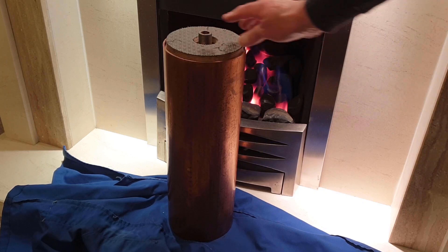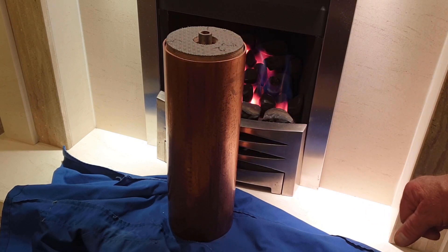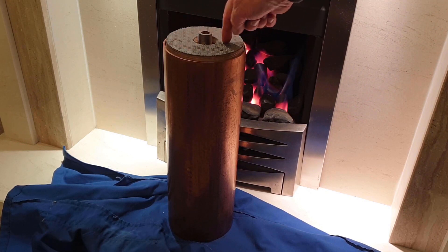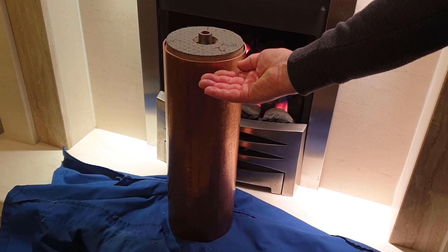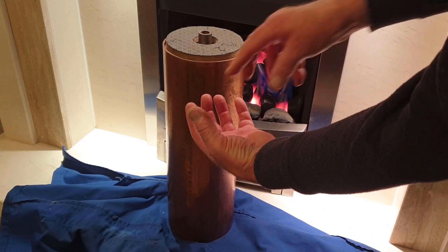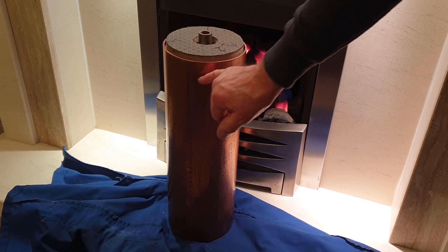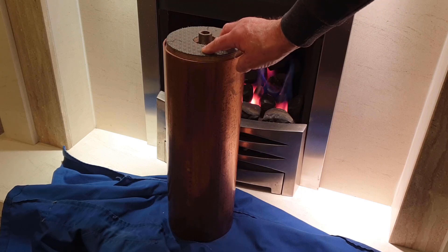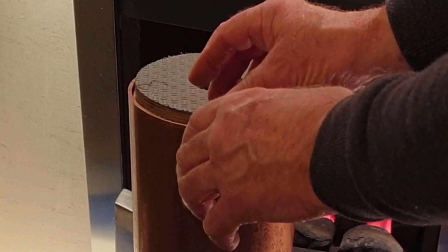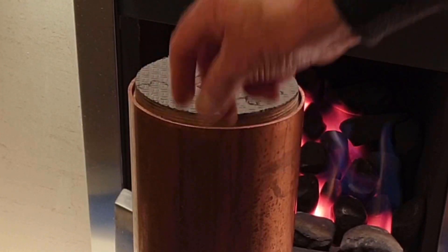So what's going on here? I've had a bit of a setback with the boiler building in that I've left this set up by the garage door and it's been quite damp of late. What we've got is a wooden former with a steel disc on the underside, all sat inside the copper dish — the boiler tube plate — which was a sliding fit inside this barrel. The dampness got into the wood, and the wood expanded, expanding the copper disc that we machined to a sliding fit inside this barrel.